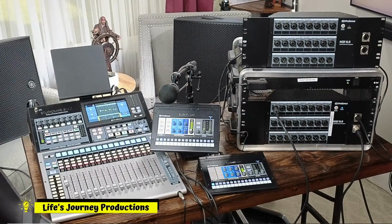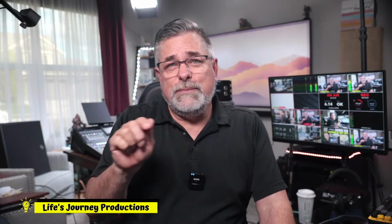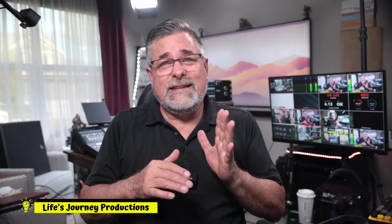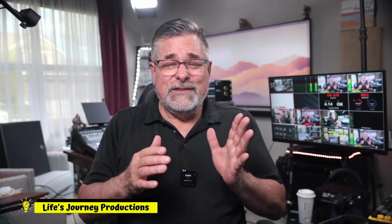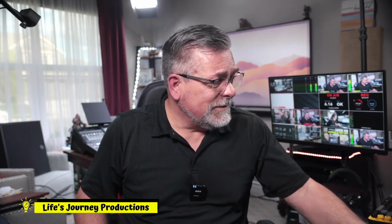So that quickly, the in-ear mix is set up. It was that simple. All I have to do is go into the settings in the PreSonus, choose the AVB sends. Again, that's the network channel. So every channel that's available in that network, I can assign it to any microphone. I can assign it to a mix. I just assigned it to my output mixes, and then those mixes were assigned to the in-ears. So it's pretty incredible. I can also assign things to Digital Snake.